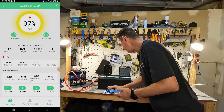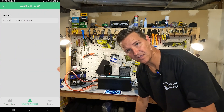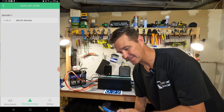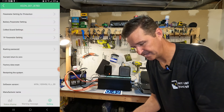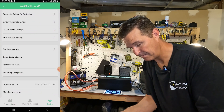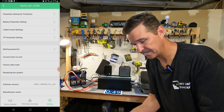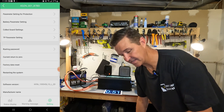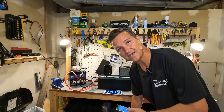Starting our five-minute timer. Under alarms in the app it shows a DSG over current alarm. Going into settings, you can see parameter settings for protections, but you need to enter a passcode — so you won't be able to get into the settings at all. Going to wait five minutes and see the results of this high amperage test.